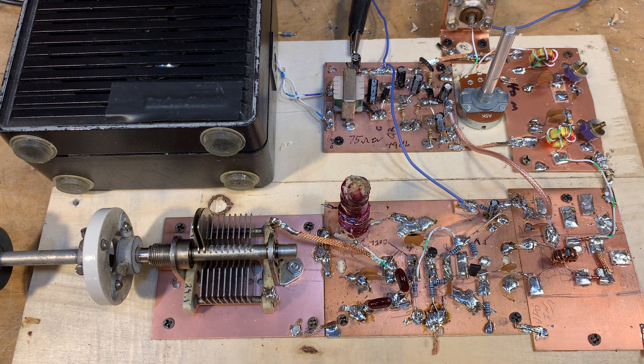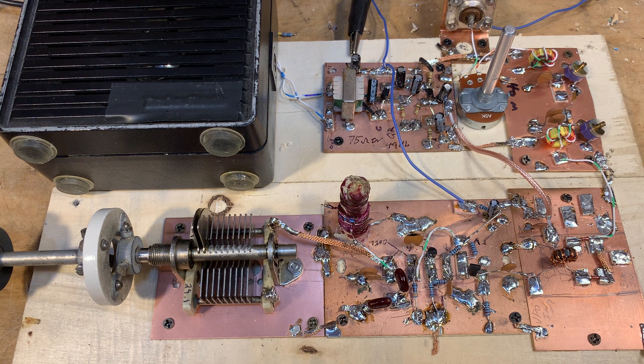The other thing I did was start doing some measurement to see how much actual gain I was getting from that RF amplifier. And it was very, very little. It probably could have been better if I had designed it better, but it was just sort of casually thrown in there — probably all kinds of terrible impedance mismatch. And not only that, I just had the feeling that it wasn't really necessary.